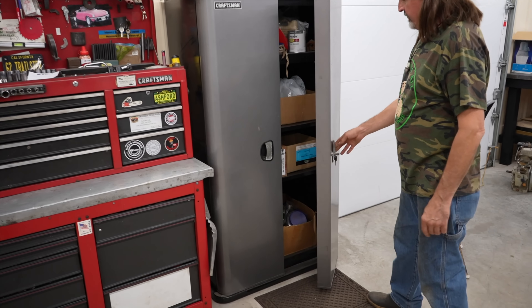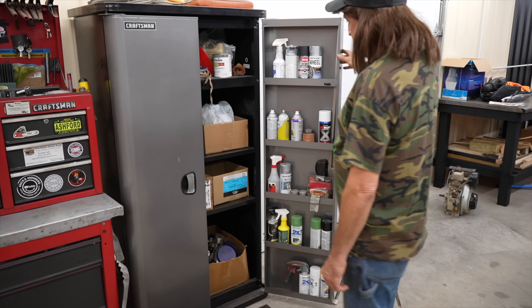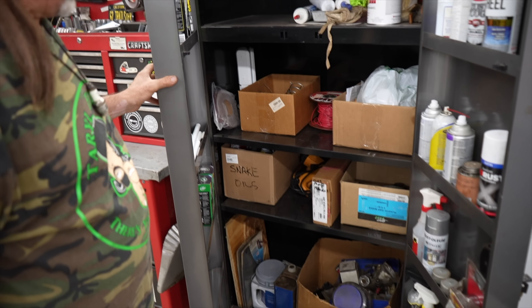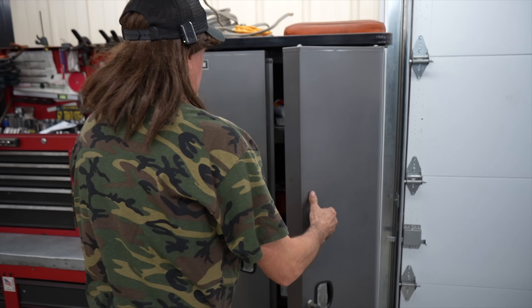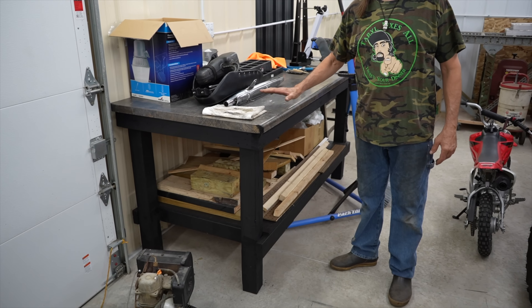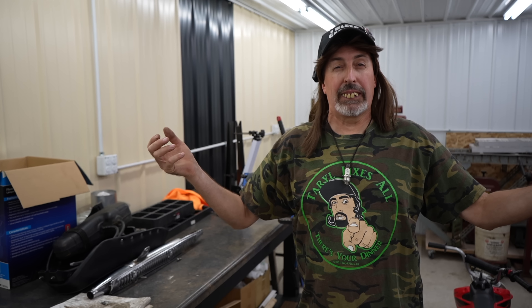So those are the reasons why I went that route and didn't use those linkable ones. Especially over here, because I had to go around this door with the electric. Like behind here, there's four outlets. I simply came off of the light fixture, drilled a hole in it with one of those step bits for the conduit fitting. So I'm using the fixture as a chase to run the wiring through. That way I was able to jump across here, come out, go down for the bank of outlets, and run around. So I got plenty of outlets.